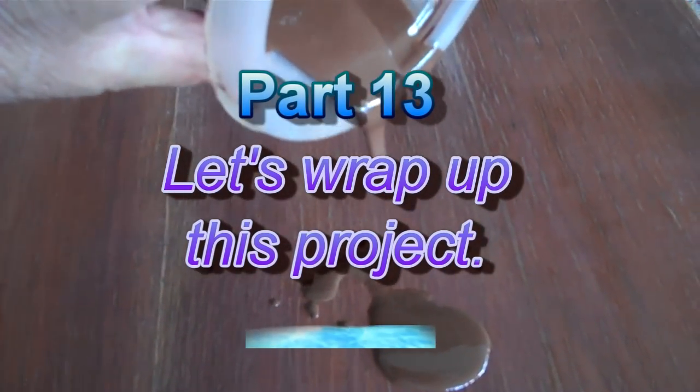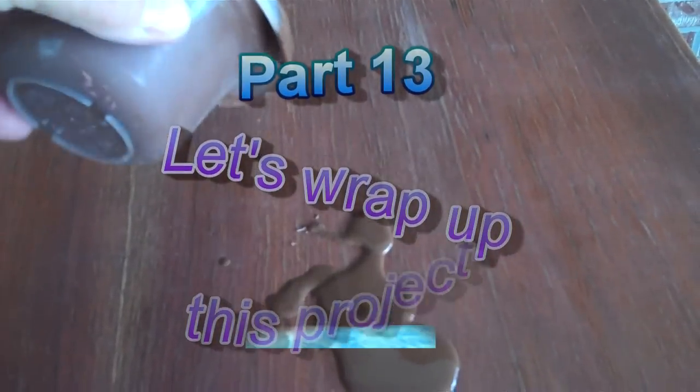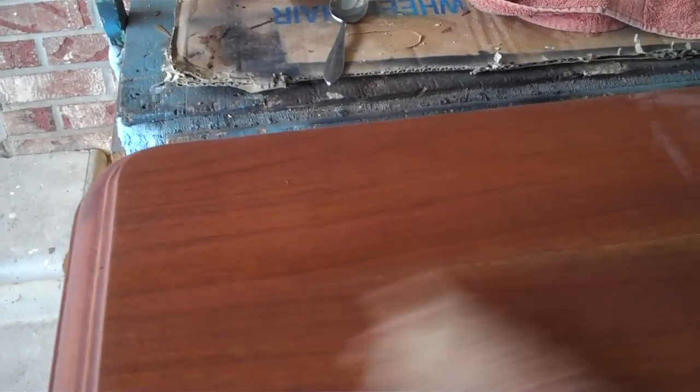On the second batch we're not going to need quite as much filler and I can make it just a little thinner. I'm going to do the same thing I did last time, only this time it's really going to be spread out thin — I don't want any thick filler anywhere if I can help it. We're ready for the second wipe down. I went along these edges a second time with the rag. When you do your wipe down of the excess filler, go across the grain, then after you get it pretty much wiped off you can go very lightly with the grain.